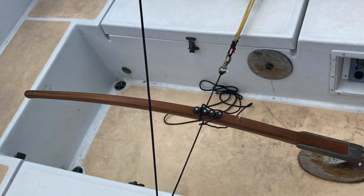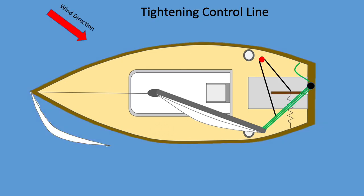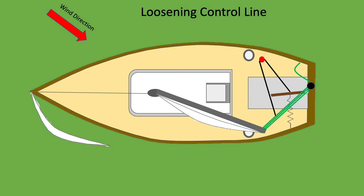Dedicated cam cleats can also be used. When setting up the system, always set the elastic where it is slack with the tiller either centered or slightly to leeward. The only adjustments that need to be made with the elastic is the number of bands, not how tightly they are pulled. The control line can be adjusted to gain a proper heading — more control line steers the boat off the wind, and less allows the boat to steer closer to the wind.